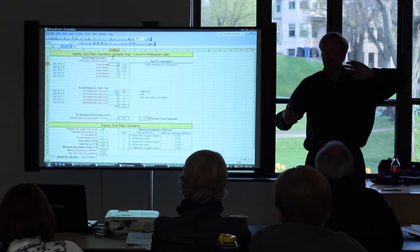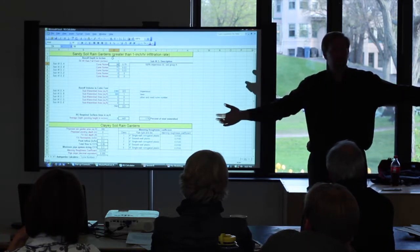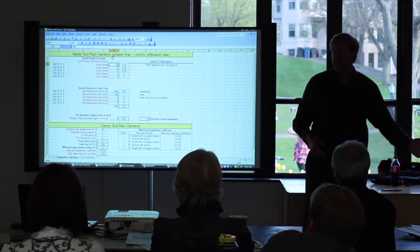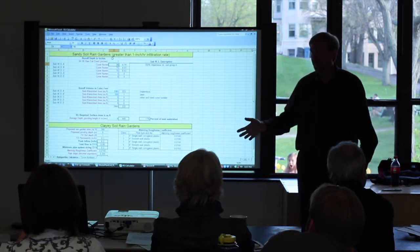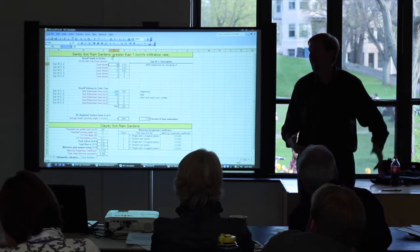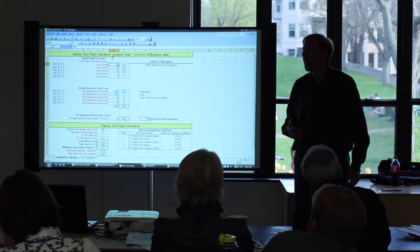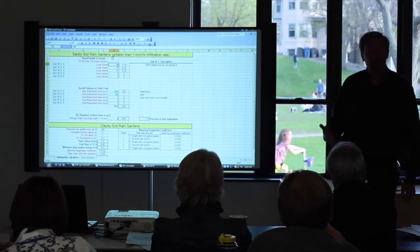I hope you've been able to play with it a little bit over the last couple weeks, because I sent it right away. But the 1 inch rain event is what you want to capture. 90% of the rains that land on our waters and on our lands here in Minnesota are 1 inch or less. Well, for now. In Kansas City it's 1.25. They have less rain than we get on an annual basis, but they get more intense rains when they get them, meaning their rains are bigger storms. So we try to capture the 1.25 inch rain event in Kansas City. In Portland, Oregon, 90% of their storm events are a half inch, so we try to capture the half inch rain event there. They get rain all the time, more rain than we have, but it's misty, drizzly rain. It's just different rains in different parts of the country. Here in Minnesota, we're going to try to capture the 1 inch rain event.